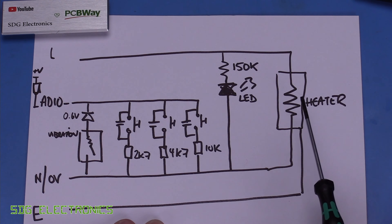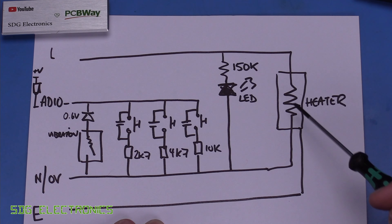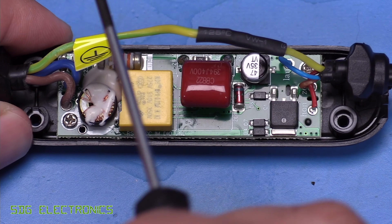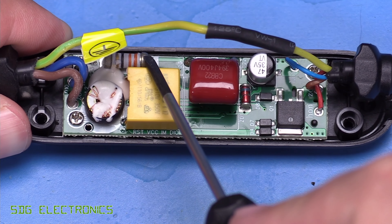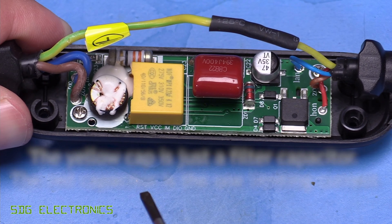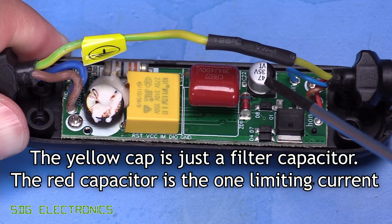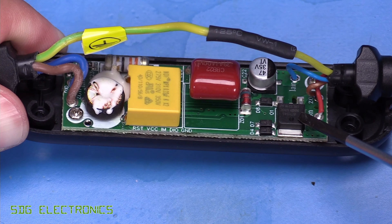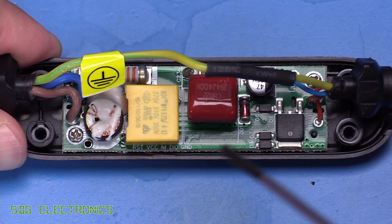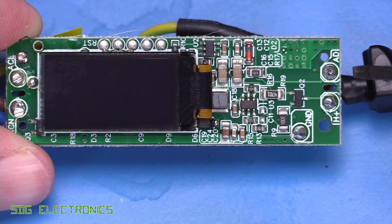There is no thermocouple or anything like that on the heater — just the mains connection. I think they must be using the resistance of the heater somehow to control the temperature. It was pretty well controlled when I checked it on the calibrator, but it just shows up as a plain resistance when connected to an LCR meter. Inside the little control unit: mains coming in on the left, a common mode choke, then a capacitive dropper, a little inrush-limiting resistor — probably a fusible resistor so it blows if all goes wrong — a little film capacitor, a snubber arrangement, a zener diode to supply the electronics, a 47µF 35V capacitor, and then a triac for controlling the heater.